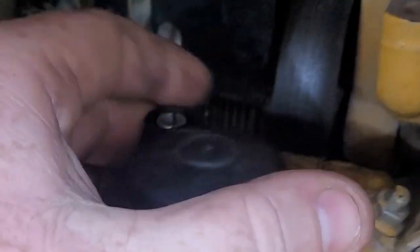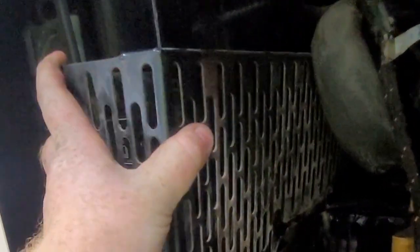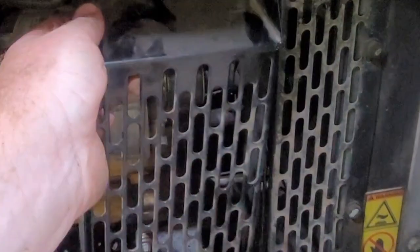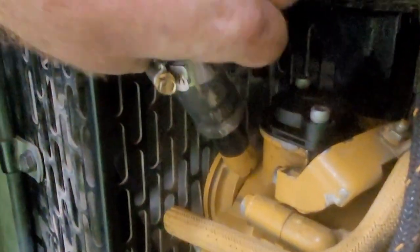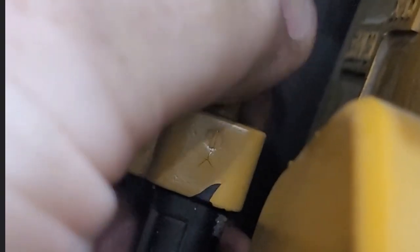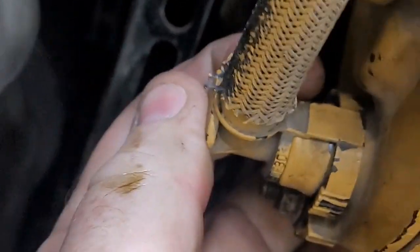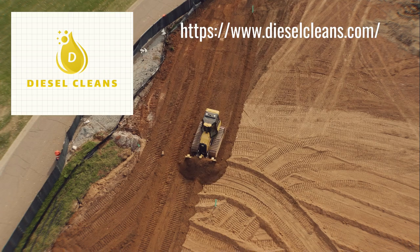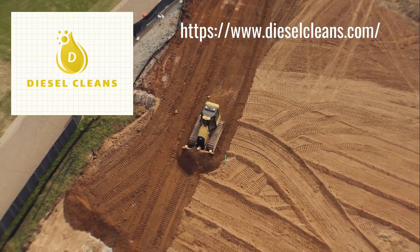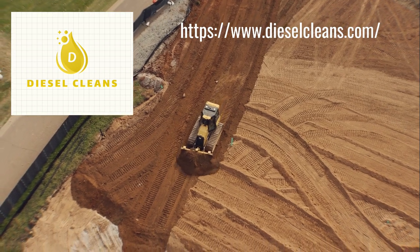Get those tightened up and slap the valve back on top. Get that strapped down, get the fan guards back in on both sides. Make sure everything lines up and get all those bolts back on for the guard and belt guard. Grab the hose, put that back on. Make sure your electrical connectors are put back on properly. Make sure you push that hose on there solid. Always make sure to throw that oil filter out with the correct disposable stuff, and make sure you do the maintenance on your equipment.